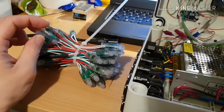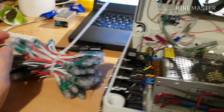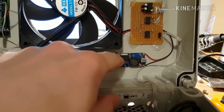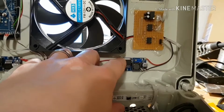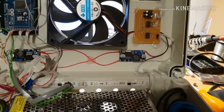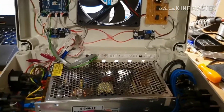And because they were quite long runs to be sending 5 volts for the lights, I actually sent 12 volts and had one of these blue power supply modules every 5 meters along the length of it. So there were around 20 or 30 of these in the total installation, and the whole thing ran off a 12 volt computer power supply, so it was much less integrated than this system, and frankly much less professional, because I did it on a shoestring budget.